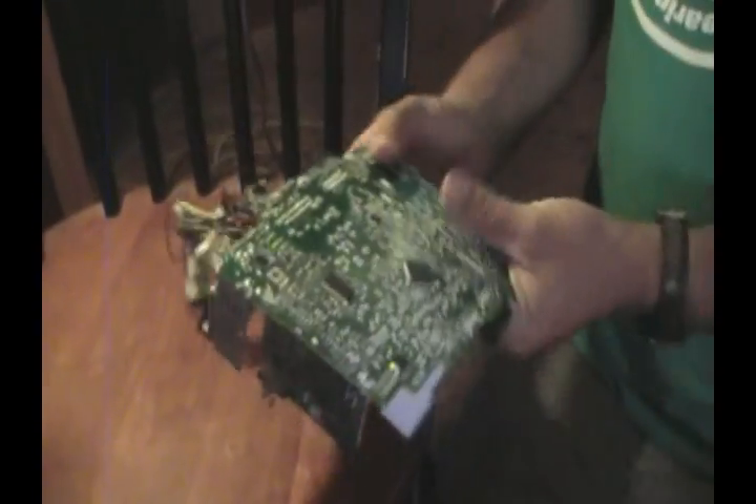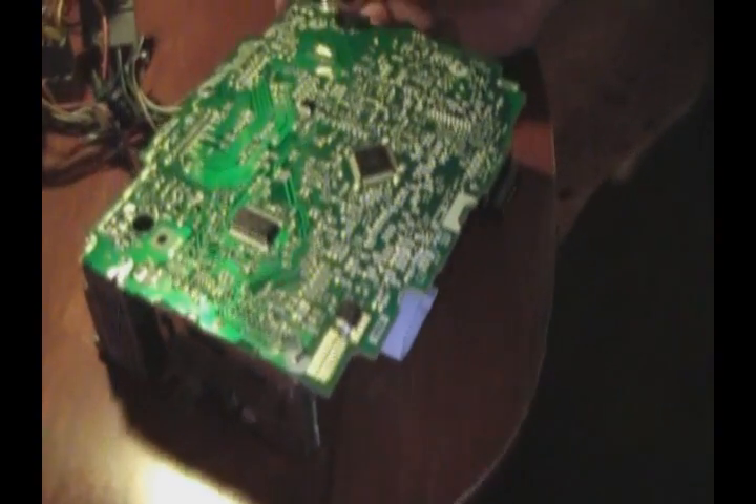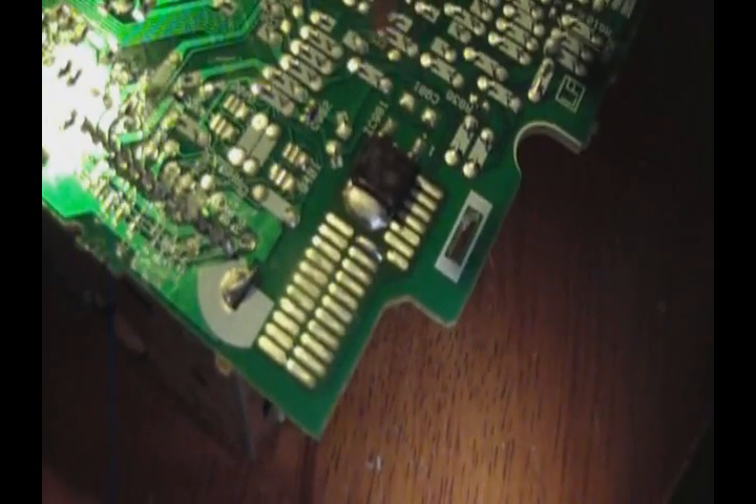Here's the PCB board that came out of it. This is where the radio antenna goes in, and they're going to have typically on these a little metal box like this. I did a Dodge Neon the other week and it worked on there too — it had the tuner box laying flat across there. But there'll be a column of pins. On this board it was really easy because you can see right there it says LCH — that's left channel — and RCH, right channel. And then there's a ground.